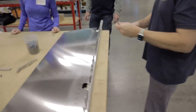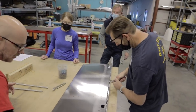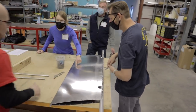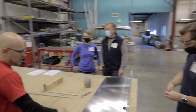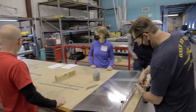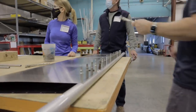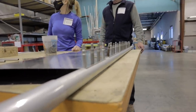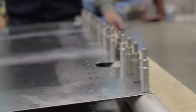You know, Coke will take sandpaper, Scotch-Brite or whatever he uses to this part here. But it's important we have them do this. So instead of just around the hole, you do the whole thing. So then it's pre-prepped. There are no burrs on the inside, and there are no burrs on the outside. So like this skin wouldn't really need to be deburred. No. So Eddie, what is this? Isn't it 2024? Or is this 6061-T6? Okay, 6061-T6. Yeah, because with the 2024, if you do that with the DA, you're really screwed.